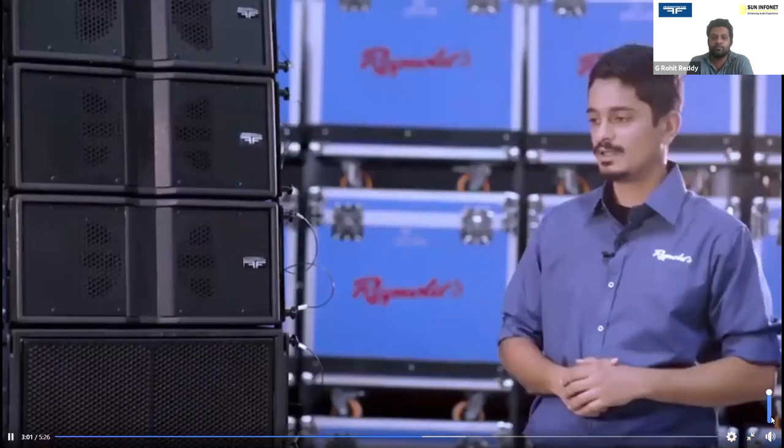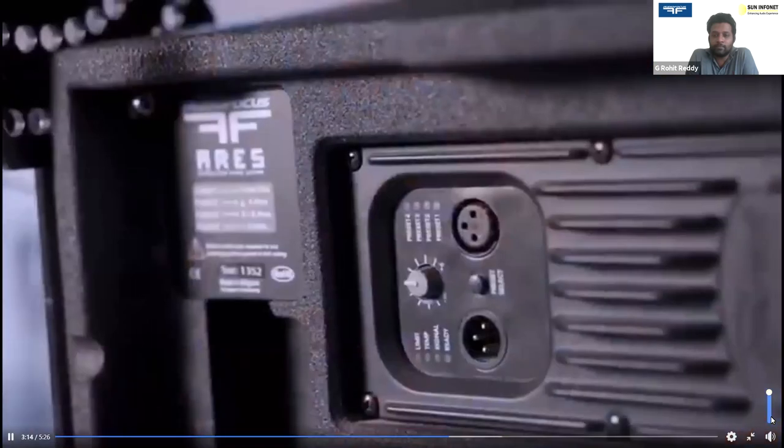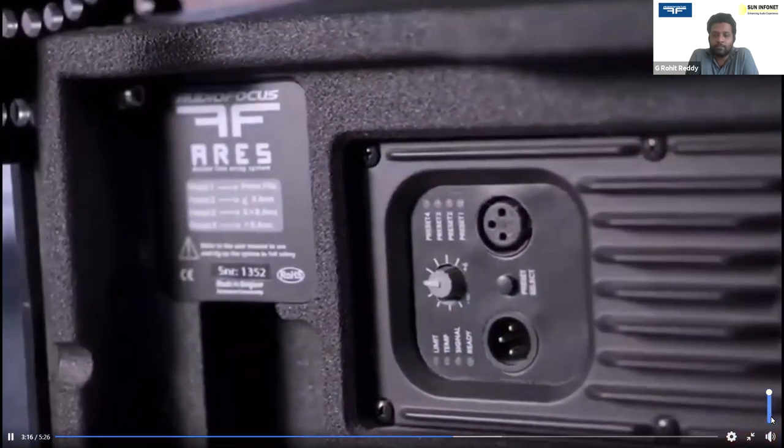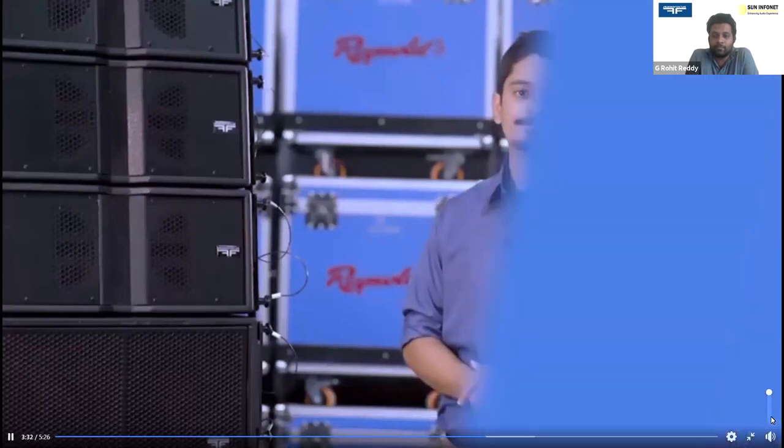So something that really got me with this little system are the single B18s, the single 18 subwoofers by Audio Focus. It's really great because with its integrated rigging, you could fly the subwoofers and then rig the PA right below it, you know, get better sub coverage to the back of venues. It's very easy to deploy in cardioid configurations as well. Very versatile, can move into smaller venues, packs a punch, and hence a system like this is our go-to for most troublesome applications.